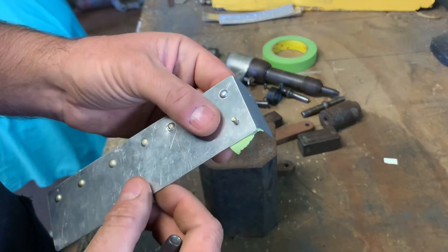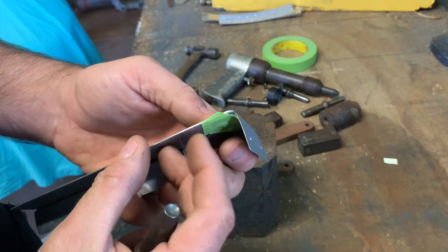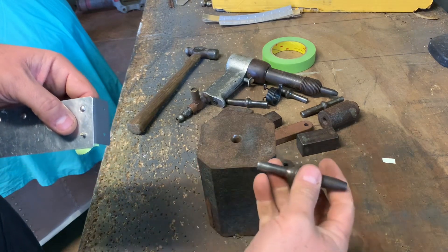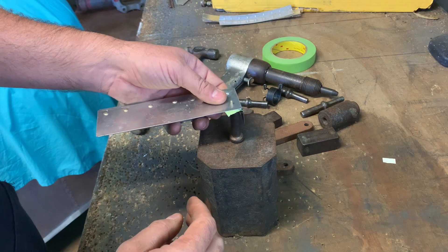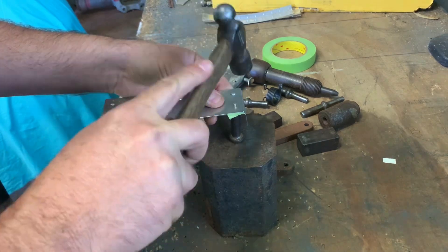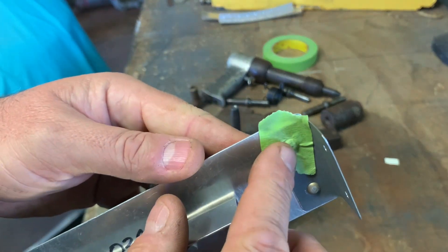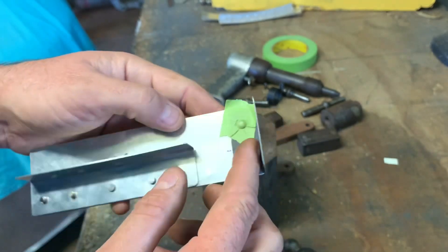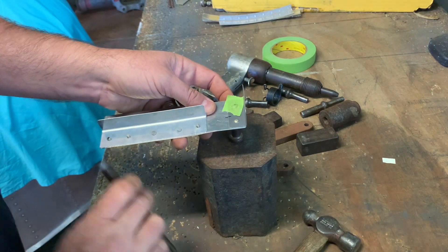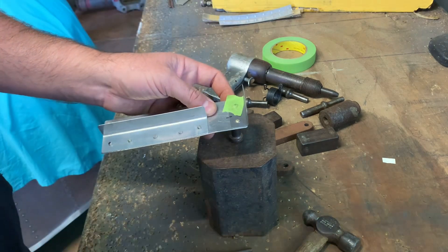Another little trick I like for small brackets, since I don't have a squeeze riveter - pneumatic or hand operated - is to get a big lump of steel, drill a hole in it so it accepts a snap, and then use that as a dolly. Then just tap that down with a hammer. Sometimes the rivet tail is on a side with limited access to swing a hammer, so another option is to get a punch, set it all up, and then hit that. A little bit more mucking around, and sometimes you wish you had a third hand, but that's how I did it.